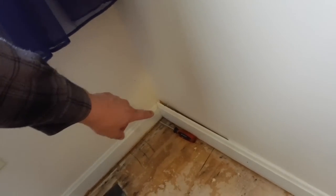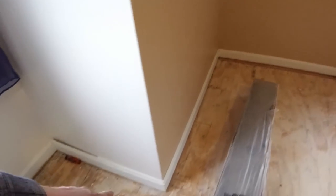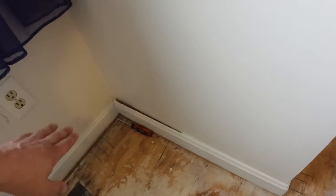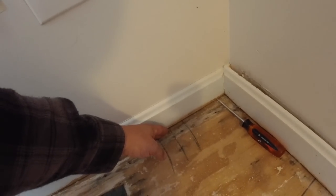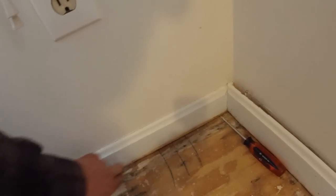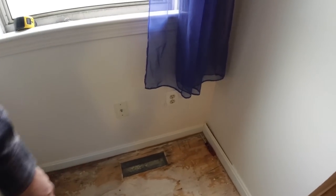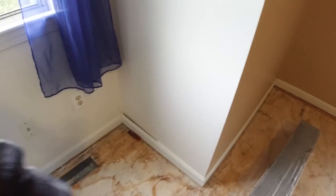In order to cover that gap — because we're going to leave a gap at the wall — we're going to go around and take off all this old baseboard and then put it back down when we're done. The alternative is you can put the floor to the baseboard and then get some molding to cover that gap. But since we want to avoid spending more money cutting new molding and putting it down, we're just going to try and reuse this stuff.